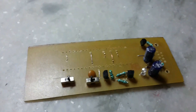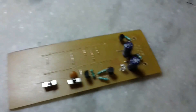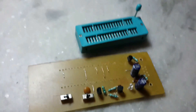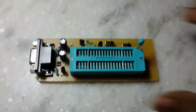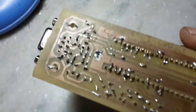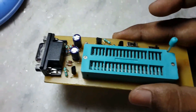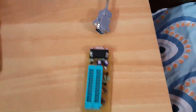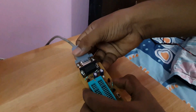Then connect the other components carefully, and finally attach the ZIF socket and the DB9 connector. Solder everything — now the multi-PIC programmer is complete. When soldering, check all connections carefully because wires can connect unexpectedly and short circuits could damage your PC.